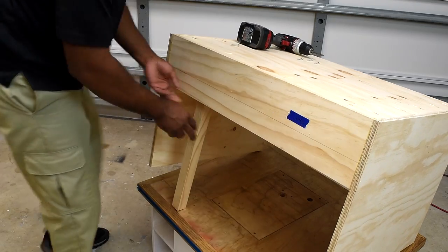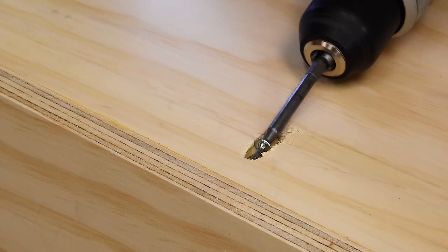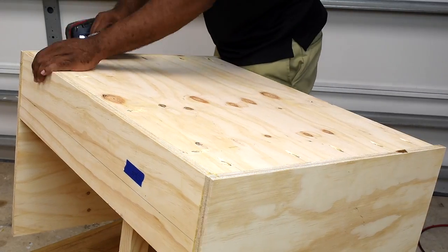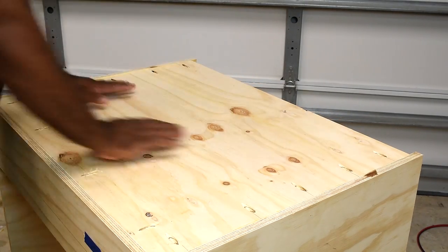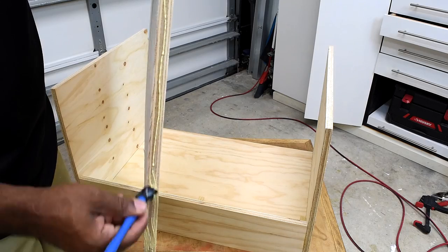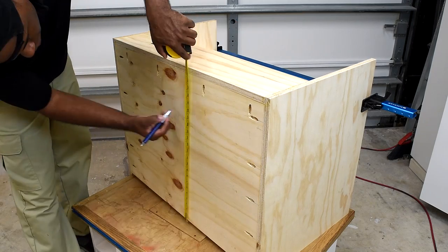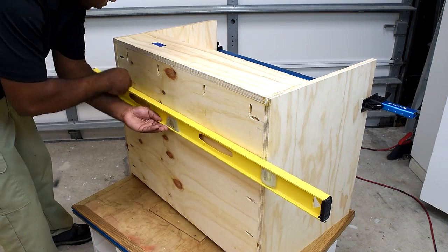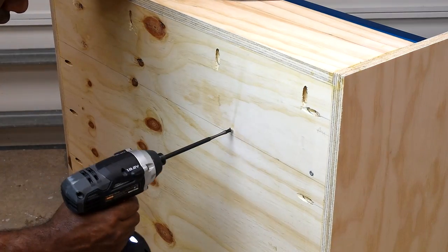It's difficult to clamp in position here, so I place a piece of wood underneath the bottom and press down — this lets the wood rise up so I can install the pocket hole screws. Then I install the back of the cabinet, applying wood glue to strengthen it. I mark the bottom so I have a reference point for where to place the wood, then draw the line.